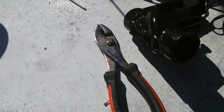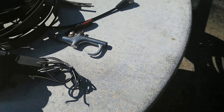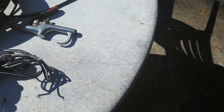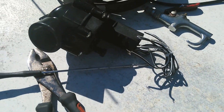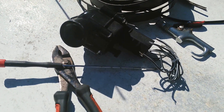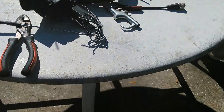Let me show you some things here on my table. This is that Rain Bird — I think it's a Rain Bird 16 or 19. What we did is pretty much: you take this off, take this off, plug up that hole, and put one of these in it. You're going to need a tap and die and a few other things. Get some good epoxy glue, glue it up inside there, get the right couplings on it, and there you go.